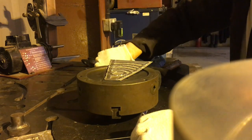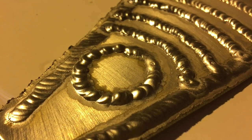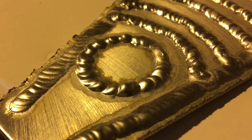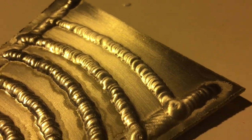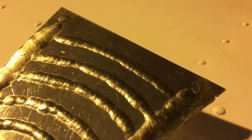See the positioner — just foot operated. It's got an old chuck clamped to the top of it there because it makes a useful sort of bed. Now, it's not pretty as you can see, and I'd like to say I'd gone from bad to better, but I think I've gone from bad to slightly less bad. The first few welds are all lumpy and wrong — I just couldn't get used to moving the foot rather than the torch. It really bugged me. There is an improvement towards the end here, though it's not what I'd hoped for. The light wasn't doing it any favours. The penetration is right through, a bit too much on some of them.